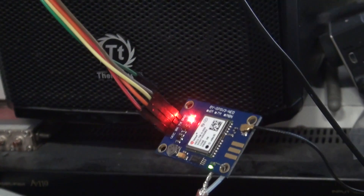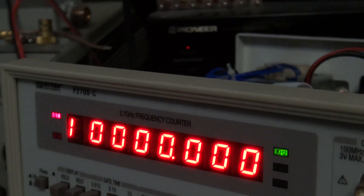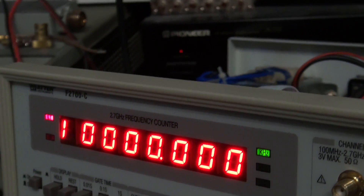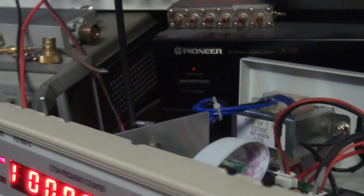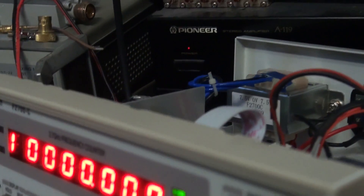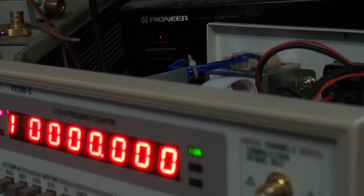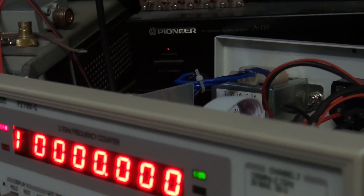As it's connected at the moment, if this GPS board were to lose satellite signal, the counter will basically just — all those digits will just go off, and for all intents and purposes the counter looks like it's turned off. I guess that's because this counter was built around that internal 13 MHz reference, and once that's gone nothing on the counter works — it pretty much looks like it's turned off.